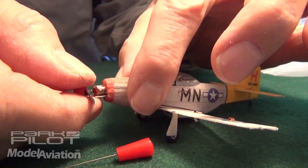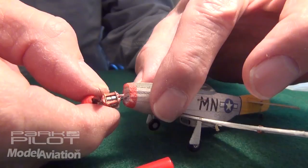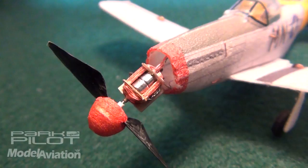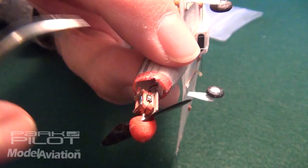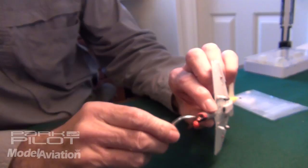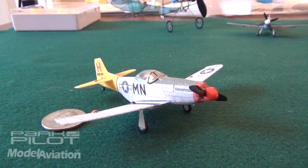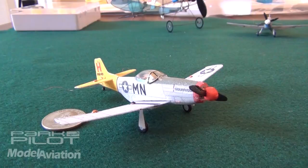So there's the motor — the wires are a little bit short on this — but what I've got is two pins in the back of the motor and the same kind of socketed connectors. On the other side, you've got this chip here that's made by a company, Allegro. That's the controller chip. What's inside there is a Hall sensor, that's a transistor which is switched by magnetic field. That senses the position of the magnet and does all the switching necessary to drive and alternate the current through the coil. I've got a program that I developed — it's about three to four thousand lines of C code — for designing propellers.